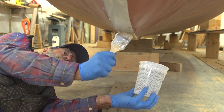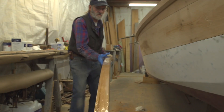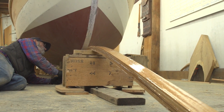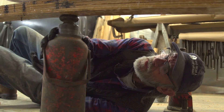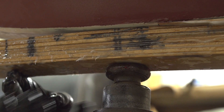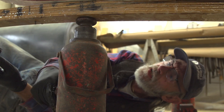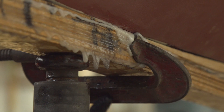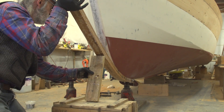There's going to be a lot of glue squeezing out of this, but that's okay. We're moving the cutwater into place — it's like a big noodle. I've got it teetering over a box so the middle is controlled and I can go down to the scarf and coordinate the position just the way I want it. The nail in there coordinates the laminates with each other. I use the jack and then put clamps across — these laminates are two inches wide and the piece I'm gluing onto is two inches wide — so a couple of clamps across coordinates them absolutely perfectly.